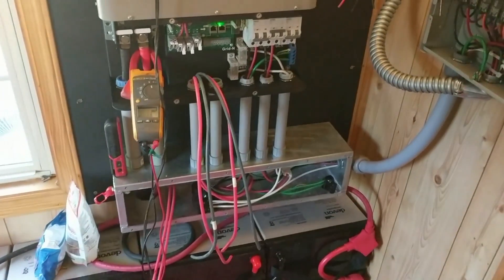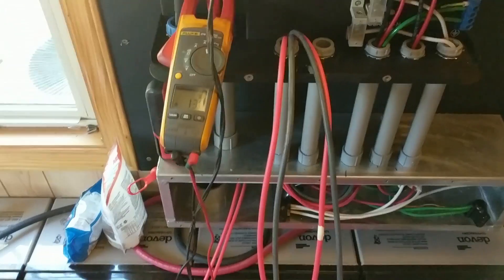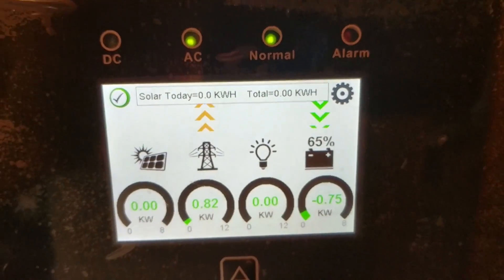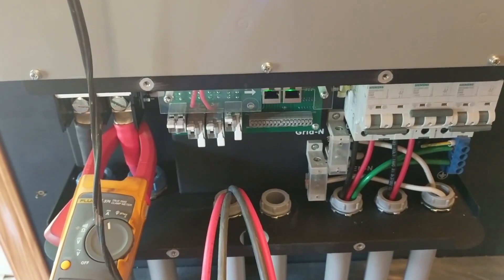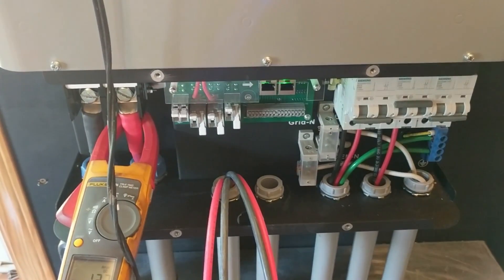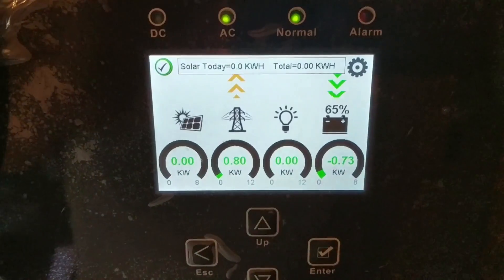Towards the end of day three, we've connected all the batteries — AGM batteries purchased from Solark. Checking the screen: it started at 22 amps, all I have is grid power on, but the inverter fired up nicely. Super quiet, no fans. We're dumping about 20 amps into the batteries, tapering down to 12. The first thing you need to do with a Solark at this point is a software update — make sure you have the latest firmware before you start using your inverter, same as you'd do with a Mate 3 on an Outback.